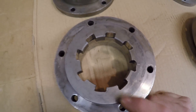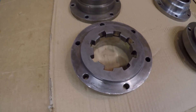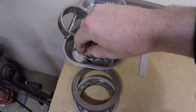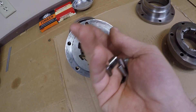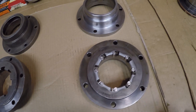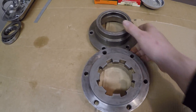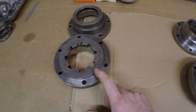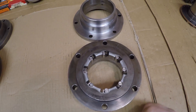The rest of the torque amplifier system is pretty well bulletproof, but the problem with that one-way clutch is every component needs to be in absolutely like-new condition for it to work reliably. Any wear on the cam ramps, any wear on the rollers, any flat-spotting, any wear on the hub - you start having problems and that clutch will not lock up. With profound amounts of wear like on these 10X pieces, horrible flat spots on the rollers, or collapsed springs, this clutch will basically start destroying itself. Hopefully this explanation and demonstration settles any doubts as to why I once again have to discard the worn-out 10X prototype pieces and substitute in good production ones. If I had tried to build this clutch in this cam cage it would have destroyed itself in short order.